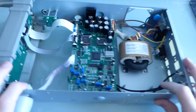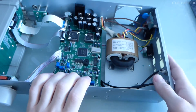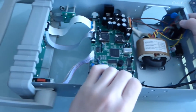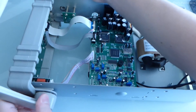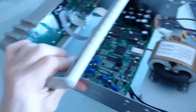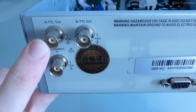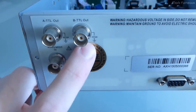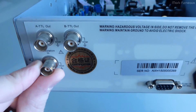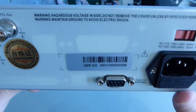So we've got the thing open now. Basically there are just two screws on the back and a small screw, the rubber cover comes off, and then the metal slides off — it's very easy to access. The tilting bail has a number of indentations. Around the back we have two TTL outputs, both 42 volt peak rated, and we also have a modulation input with the same rating, which allows you to do frequency modulation, phase modulation, things like that.